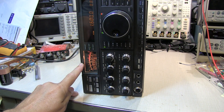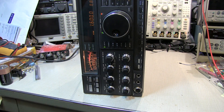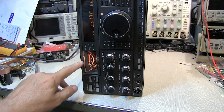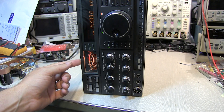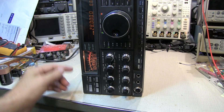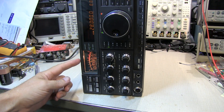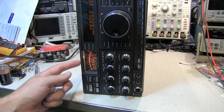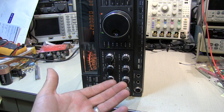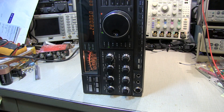At the lowest amateur band the same minus 22 dBm gives about S7–S8, slightly frequency dependent. At 3.5 megahertz it's S9, and about the same at 10, 14.2, 18, 21, 24.5, and 28 megahertz — all about the same. No dramatic change across the bands, so the problem is not in a particular filter or frequency-selective portion of the circuit. The loss is consistent across the entire frequency range.